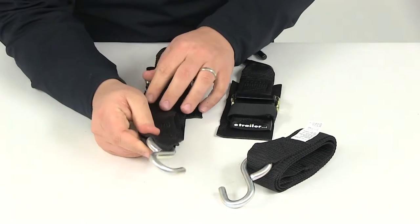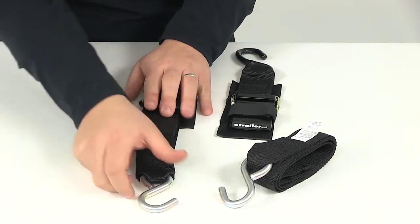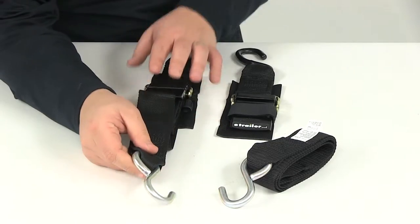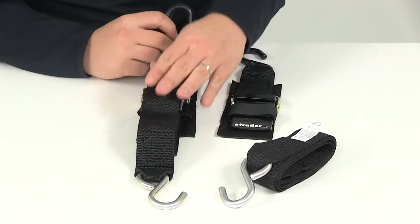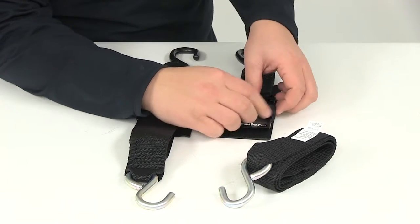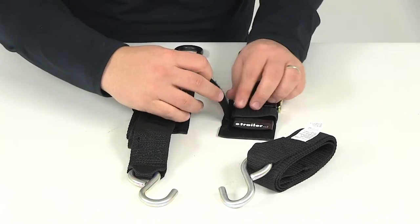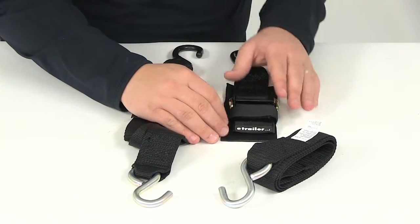The way that this would work is you would load your boat onto your trailer. You need to open the buckle and hook the zinc coated s-hook — which would be this one right here — at the bottom of the tie-down straps to the side of your trailer's frame. Then you can hook the vinyl coated s-hook to the stern of the boat. You'll want to pull the end of the strap through its buckle and then turn the buckle down in order to tighten it. It's got these nice hook and loop fasteners so you can secure the excess strap, that way it's not flapping around or making road noise as you go down the highway.